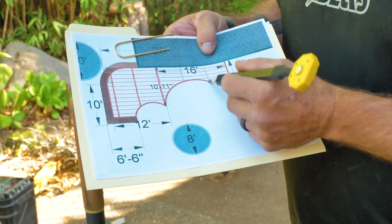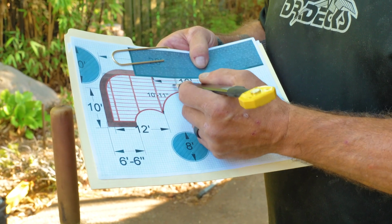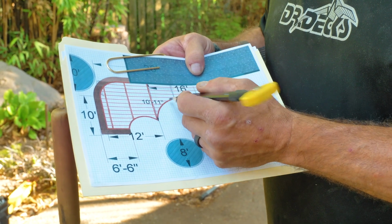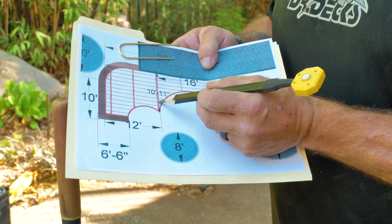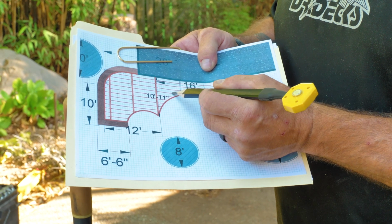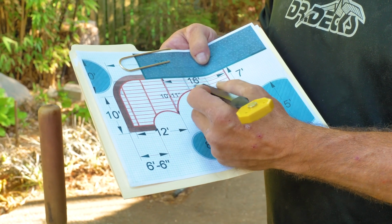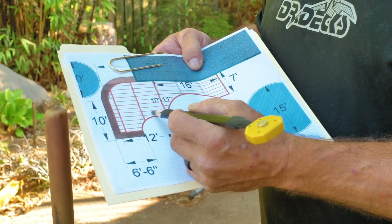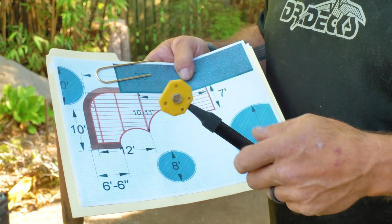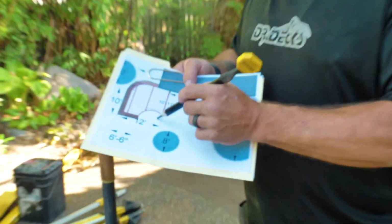These are going to be like 4x4 beams, and we're going to hang 2x4s in between about every 5 feet into these sections. And then we're going to be creating a curve. So we're going to be doing some flat blocking in here, like this, to support our curved surface borders. So that takes some time, but we're going to start by framing this section over here first.